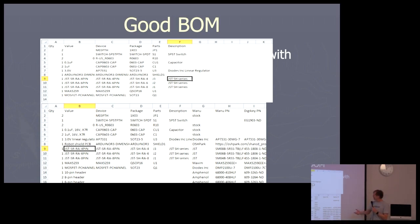Otherwise, somebody can, you know, how these part numbers get really long, and it means, oh, it's a different kind of SMT package. It's not going to solder down. It may look on the website that it's right. It's still a quad flat pack, no pins, but it's actually a different size. You get it in, you'll go, ah, it doesn't fit on the board. So give them as much information as you can on the right parts.